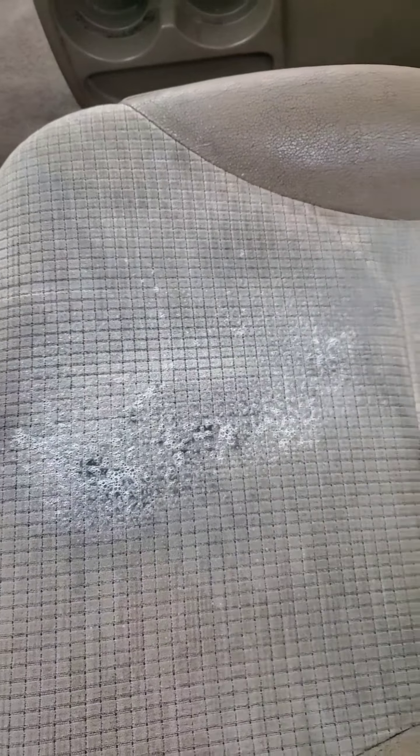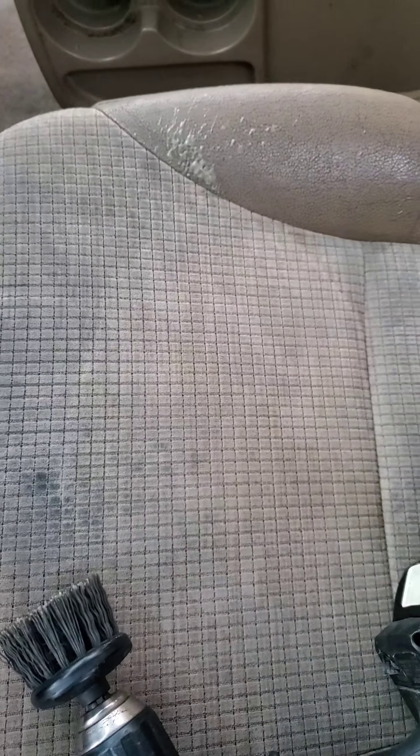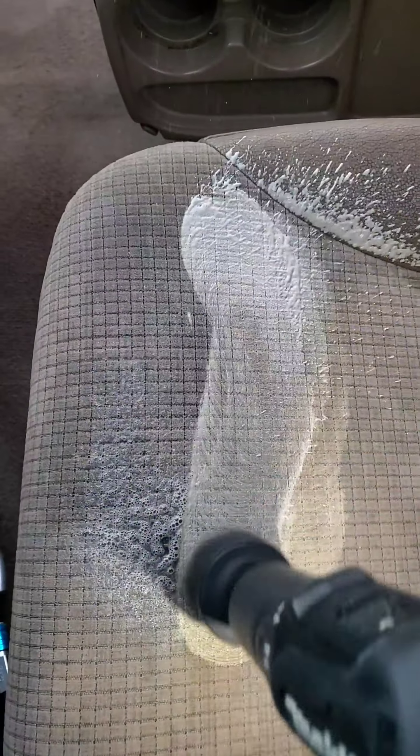Now I'm going to go through with my drill. And then I'm going to go through with a grimy towel and remove all the dirt that's been surfaced. Just look at that amount of dirt that's been surfaced. When you see those guys with all the extractors pulling gunk up after they've already laid down a bunch of water, all they're pulling up is this stuff. That stuff shouldn't even be running through their extractor — they should be wiping the surface prior to any extraction or steaming.